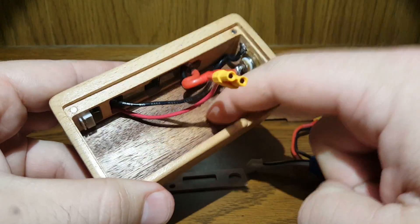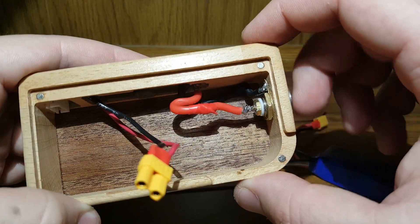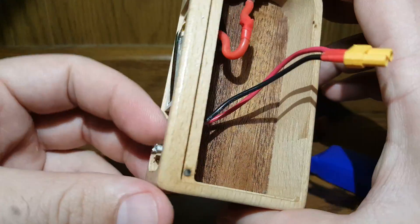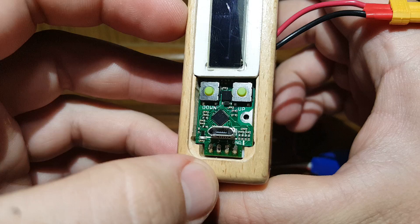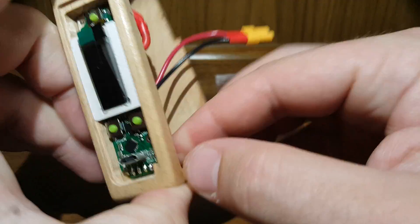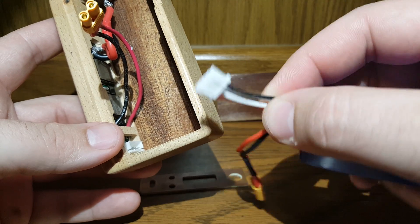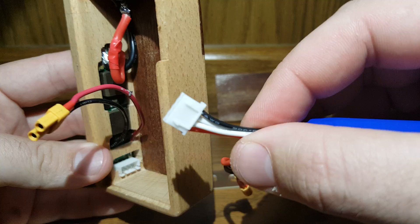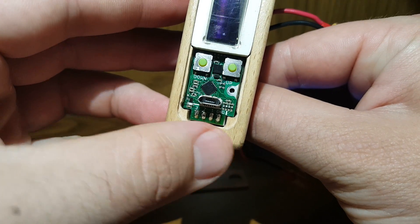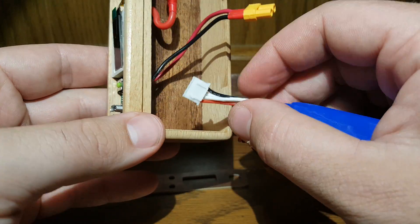If you watch my latest video before I put the battery tray in, I had the battery input lead - nothing changed with the atomizer connector, that stayed the same, 14 gauge. Now, if you followed my first video, remember I made mention of the ground - making sure the ground lead on the right, that first pin on the back, meets up with the black on your tap. This tap was completely backwards. I had it the other way, so ground would be plugging into pin three - that's going to fry it up most likely.